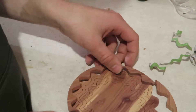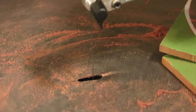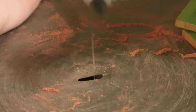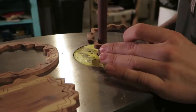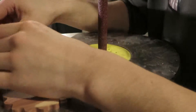And now put them all back together so you don't get them mixed up. I'm just using the blade as a sanding aid for getting some of these pilot holes disguised, because you'll still be able to see them. You can kind of just blend them in with the rest of the pattern if you use the blade like a piece of sandpaper. And over at the spindle sander, we'll also disguise these pilot holes on the interior.